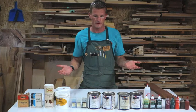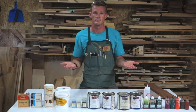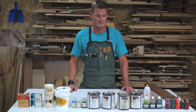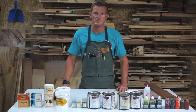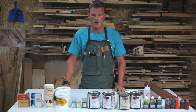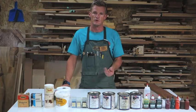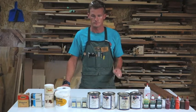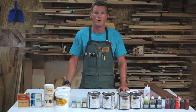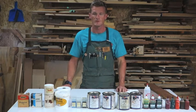Grain filling is a great way to add color to your wood. It creates a beautiful piano-like surface and adds a nice touch to your final coat. One thing I neglected to mention is the various open grain woods we use: ash, mahogany, walnut, and oak. For ash you would need about two to three coats of grain filler. For mahogany, three to four. For walnut, one to two. But for oak, being the most open grain wood, you would need eight to twelve coats.